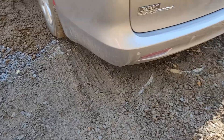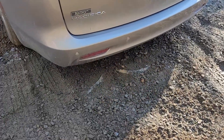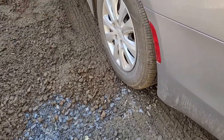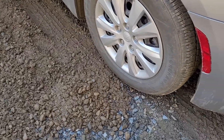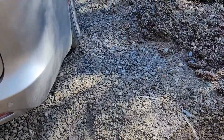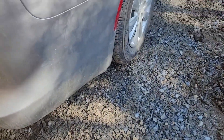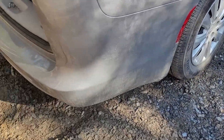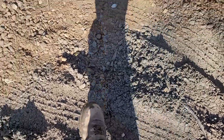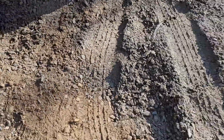These are the tires we just laid. We haven't done any tamping, we haven't done anything special other than walking on them. This is how they hold up because the pressure from the car pushes down onto the gravel, which then pushes out into the walls of the tires, which makes it so they can't really go anywhere. It's like a spring and it works great, even when you completely half-ass the job.